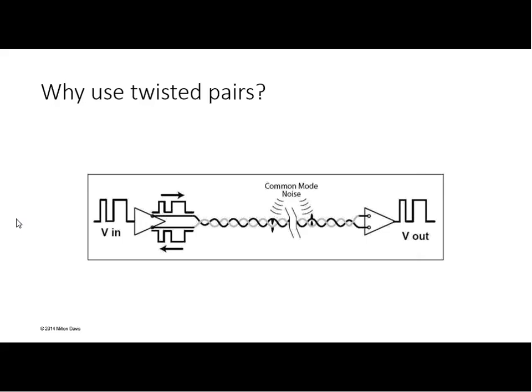Yep. There were times when certain large lighting companies, the only way they could get through UL, basically put 10,000 ohm resistors in their ground wires. It works okay with some transceivers, but not with others, because they're essentially running with pin one, which is the common, open. Yep. Cool. Thank you. Let's move on to the next.